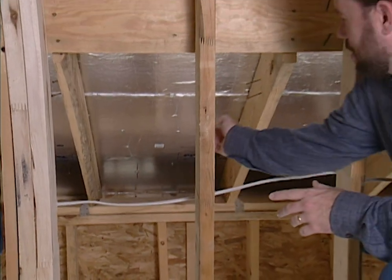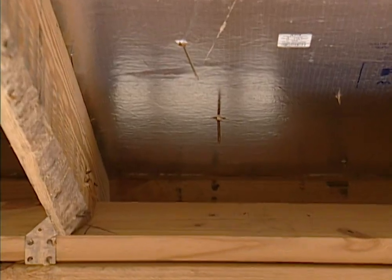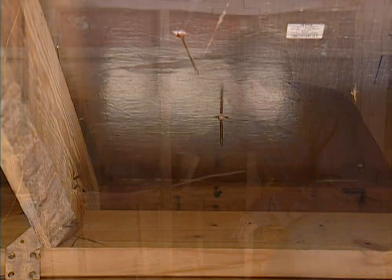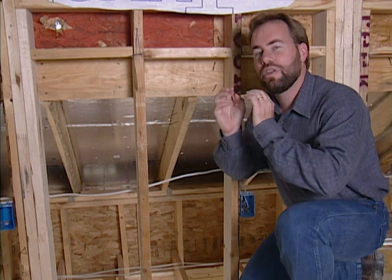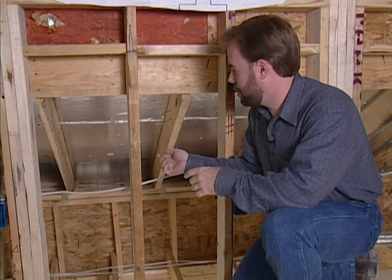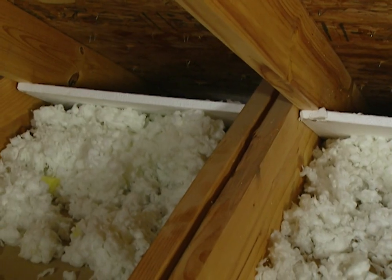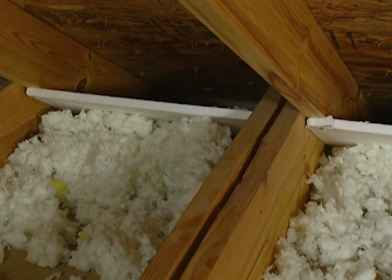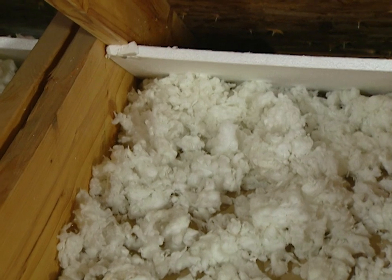It's hard to get back to actually see the vent itself, but it's on the other side of the wall plate where we have our soffit and fascia. You can see a little extra light down there — that's from outside — and the air comes up through there and runs between these rafters in this cavity, helping push the hot air out of the attic. A lot of times when they blow in insulation they blow right over that vent. You can go outside, unscrew your soffit vent, and you'll likely see a lot of insulation. They'll staple in a plastic or foam baffle that lets air through on the backside but prevents insulation from blocking it.